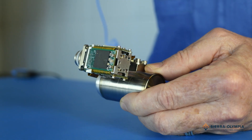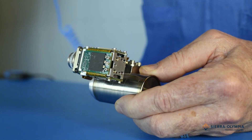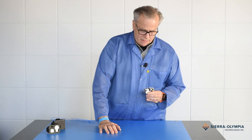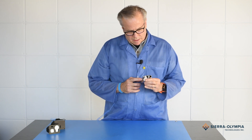One thing about the expense of a mid-wave system is that you expect the cooler to wear out, and then you have to take your camera down, ship it back through the supply chain, get the cooler repaired or replaced, and you're without a camera for 6 months. This cooler is by far the longest life cooler on the market.